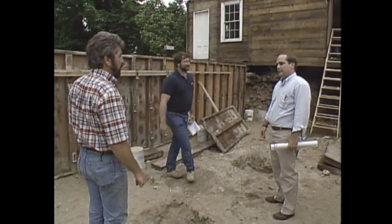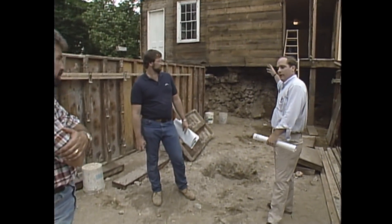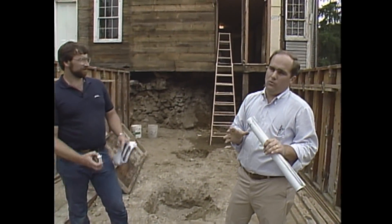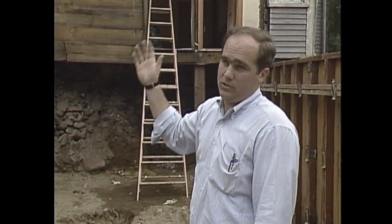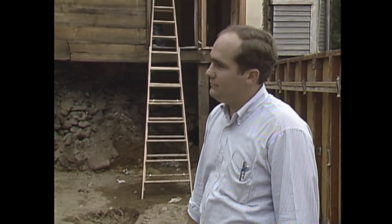It's a tough one. Hi, Norman. Hi, Rich. Good. What do you propose? Well, my first reaction is to run duct work off the main system and run hot air out here and heat this space with the main house. Are there any problems with doing that? There are. It's difficult to zone a hot air system to get a good, comfortable temperature here without overheating the main house or vice versa. What I'd like to recommend is radiant floor heating — a heating system where the heating is actually in the floor. Oh, I don't know. You're not talking about those horror stories about slab-type houses with the copper piping that goes through the slab? And it turns out there were a few thousand of these built and now they're all being retrofitted because the concrete ate through the copper pipes. Right, we're not going to do that to our new homeowners here.